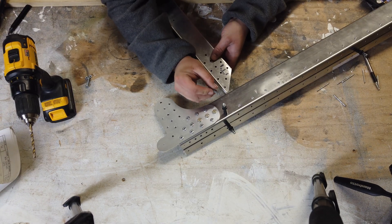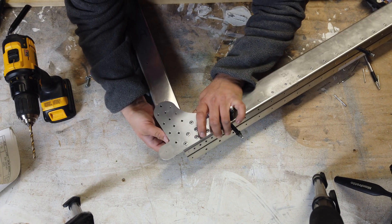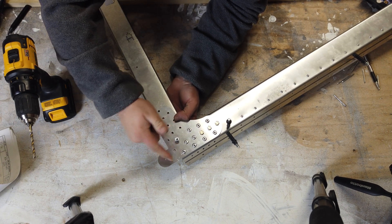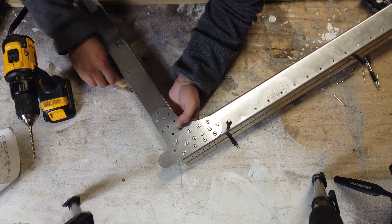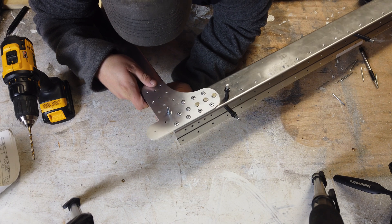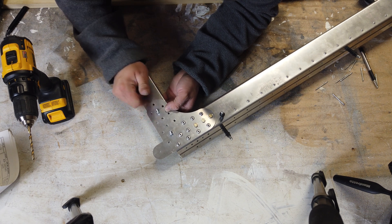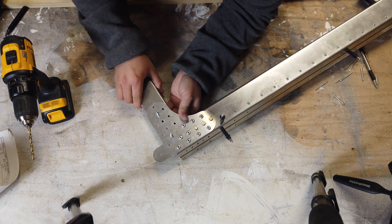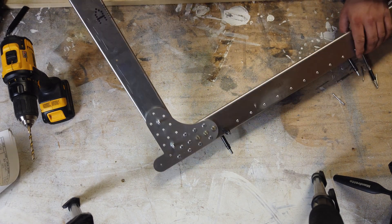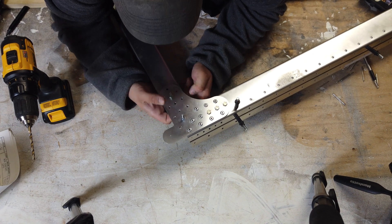If you want to see what I'm doing: I take a 3/16-inch bolt — just one I had laying around — find the middle hole right here, it pops through. No need to go out and spend a bunch of money on clecos because this works just as easy. I'll find one a little further down too. Before I tighten both of these down, since this is a new piece it's got a little flex, I'm going to triangle one right there to keep it from moving.